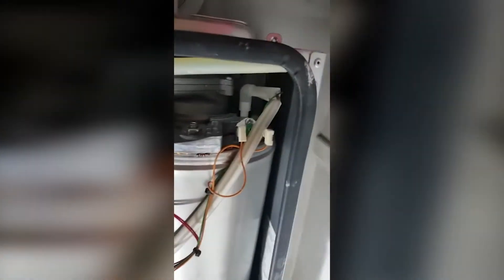As you can see, this boiler will need a new flow gasket as well, as it's breaching the top of the burner seal, so we'll change this also.